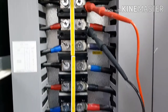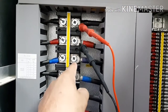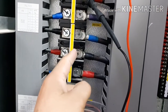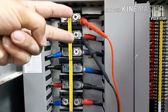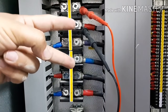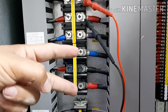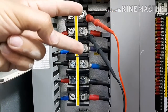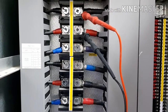I'm just showing — first you will connect one and two, after that connect the third and four, then five and six. So two by two you can check: first do these two, then these two, then these two. You can also cross-check between groups. This is a simple rubber cable, not an armored cable, so for the simple rubber cable you should do it like this. It's very easy.